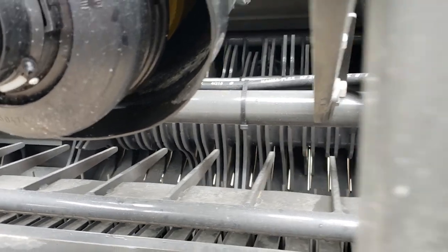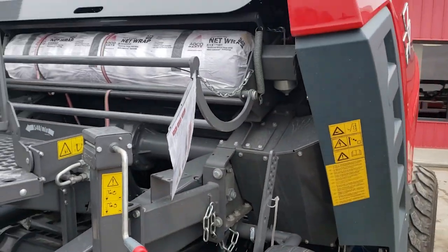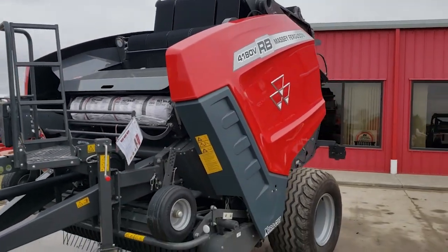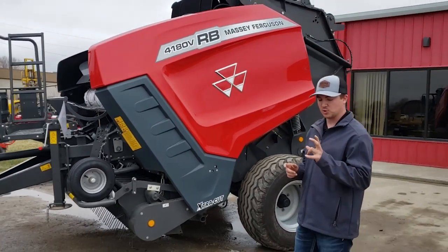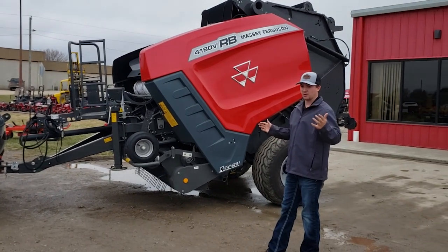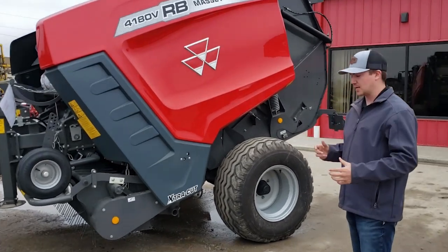If you're wanting to take your hay and just roll it out onto the ground and not have it fall apart, you have what I call dummy knives that you can stick in there. So your hay is cut not between 3 and 4 inches long, just like your normal round baler would do. You put those knives in so you don't have to actually cut any hay.